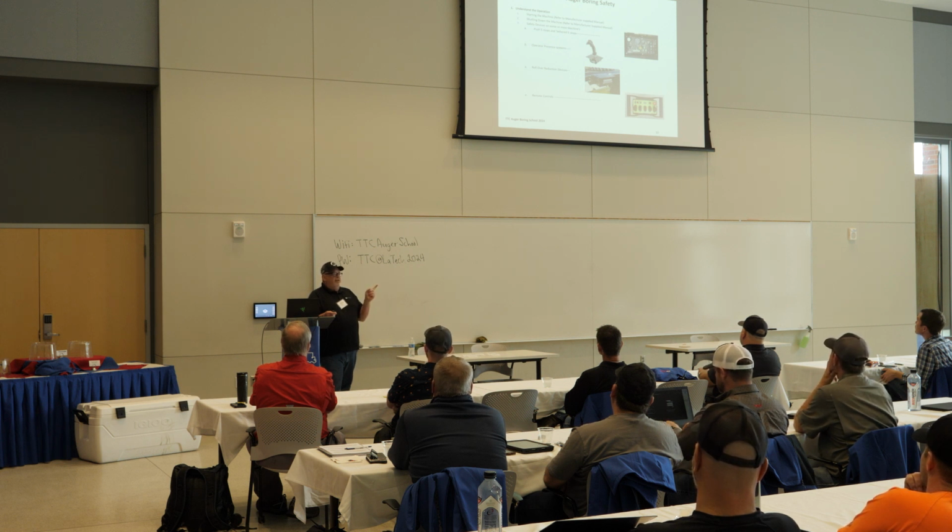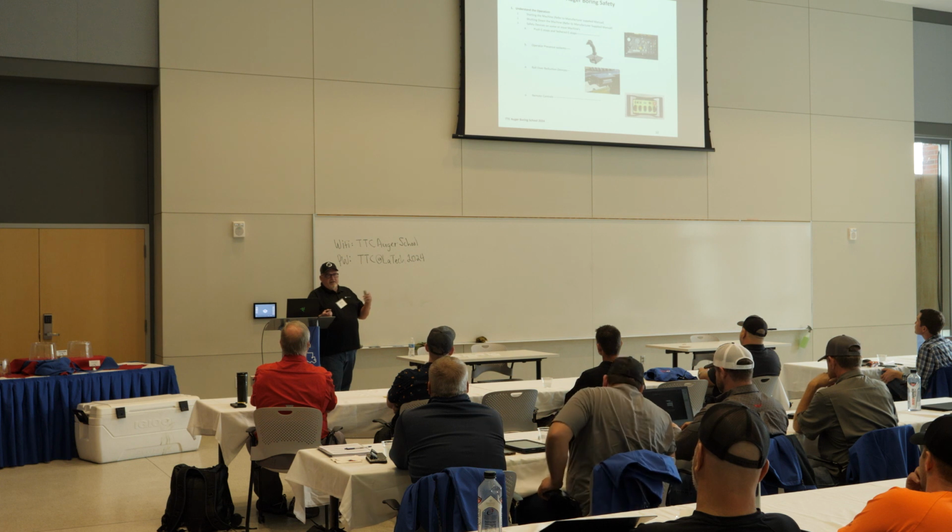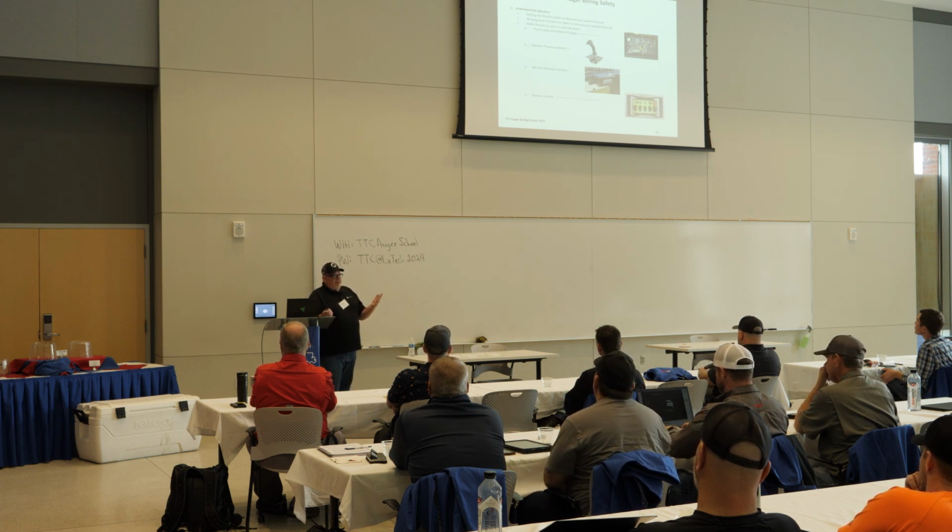You let go of that trigger, the auger stops. So what they do, they wire tap it. Now you can't stop the auger at all. So try not to bypass safety switches. That's what they're there for, to protect you.